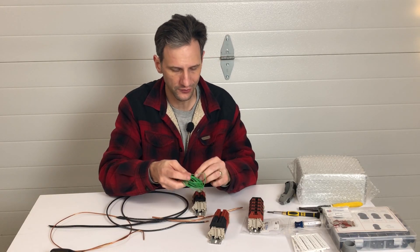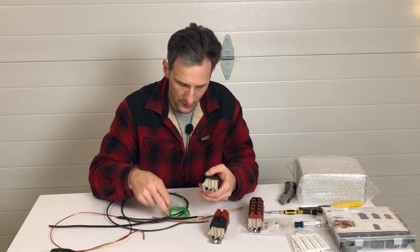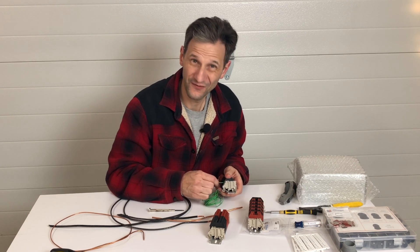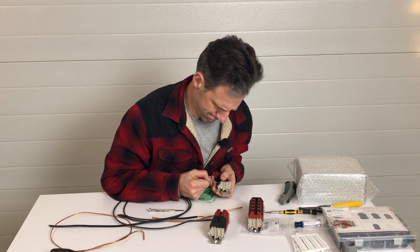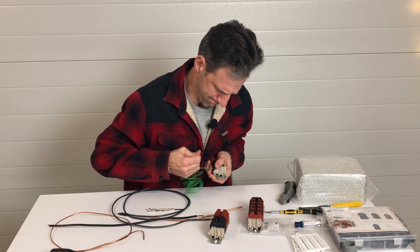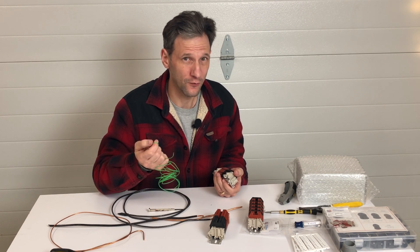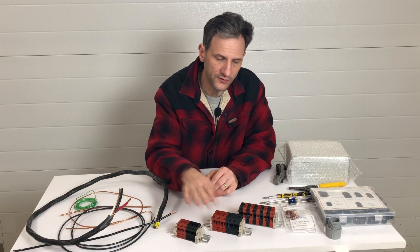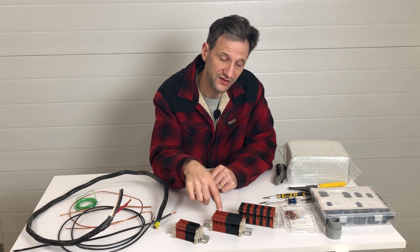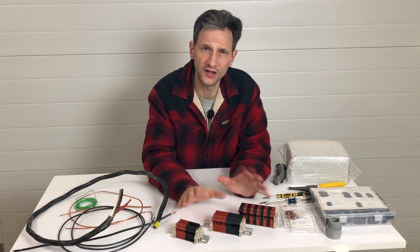But what about tiny wires? Here's the minimum size — 22 gauge — and this is the smallest block, the DK4N. Let's see how well it holds tiny little wires. It's definitely very tight. I'm able to get it out, but it takes more than 20 pounds of force. There are three different sizes represented here. The designator is DK: DK4N, DK6N, DK10N, and it goes all the way up to DK35N. These are the sizes that make sense for most solar installations.